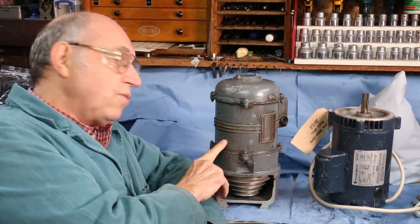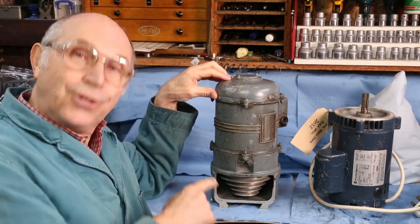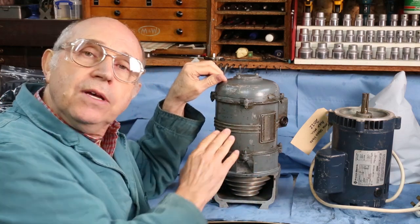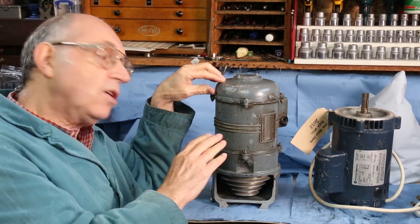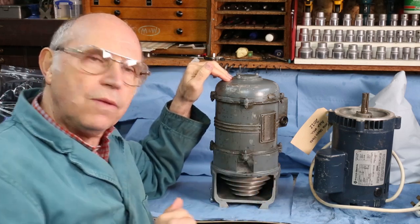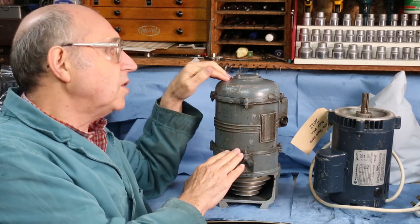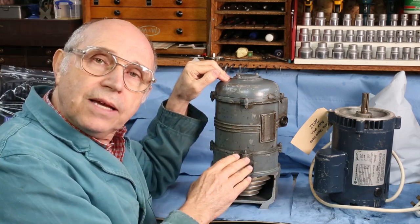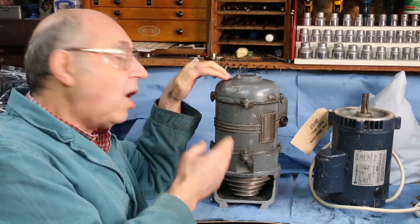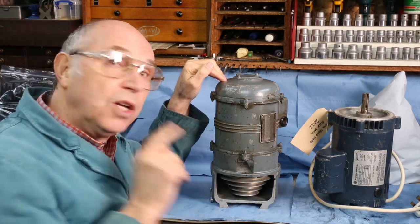Luckily he didn't dispose of the original motor, and I want to put the original one back on. The first reason is because it looks really nice — it's a beautiful looking motor. The other thing is it's three-phase, so if I run it through an inverter I can control its speed with a knob, which is great for setting up the cutter speed on the mill. However, this motor hasn't been used for 20-plus years, so I want to take it apart, clean the bearings out, repack them with grease. I happen to know the bearings are fine because I've had it apart already and rebuilt it — but don't tell anyone.